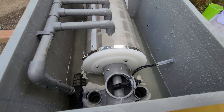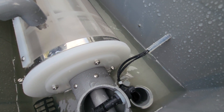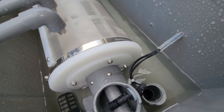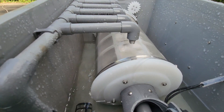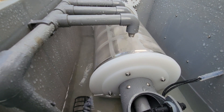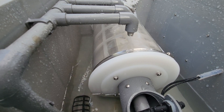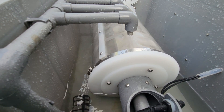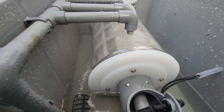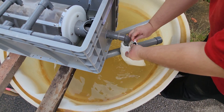From the top front view, you can see that despite removing lots of solids inside the screen, the water on the outside of the screen is still very, very clean. You don't get any of the shrimp feed passing through, which shows the success of this drum filter. By washing it, the waste flows through the middle pipe. A pump is used to backwash and wash off any solids sticking onto the screen, and the waste gets collected in the front.